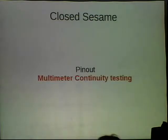This is a pretty average multimeter. They're cheap. I like them. And they have a mode where, I'm sure a lot of you have seen this, you just touch the pins together and it makes a beep when the pins touch. That means you have found one end of the wire all the way to another end of the wire.